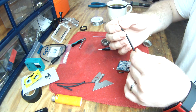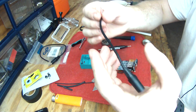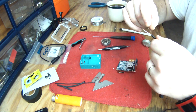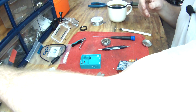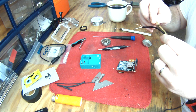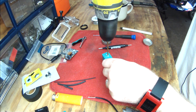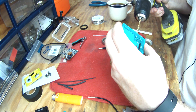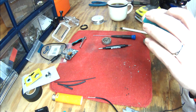I have some big thick solder here but I hate working on small things with it. So I have my favorite invention ever — my solder pen, which is just a coil of solder in an old pen. It works great for applying solder without getting your hand too close or having wiggly, drippy wire. Just a little bit of heat in the wire and then just a dribble of solder on the end. Now that this is tinned, I'm going to figure out how I'd like it to come in, and I think I'm just going to drill a hole and open that up to about this thickness. Snugger is better — I'd like it to have a little bit of contact tension so it doesn't pull back. Here goes — drilling into the Yi case using the old microphone inlet hole. And that's it — we're through.